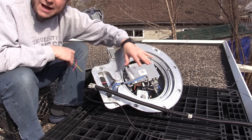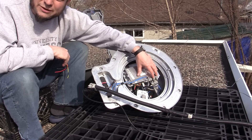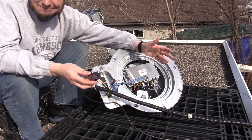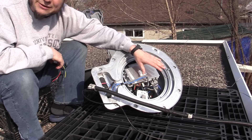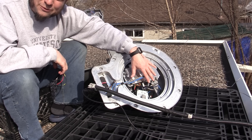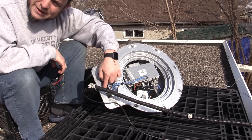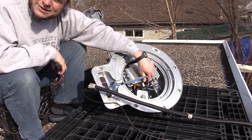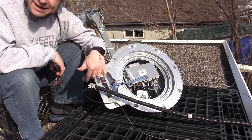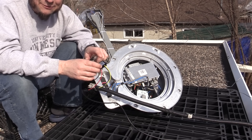I've got this flipped over and the bottom panel removed. I was going to put a little buck converter in here attached to the brain of the outdoor unit — this provides 16 to 18 volts, and it wants 12 to 24 volts, so that was going to provide 5 volts out to the first LNA in my RF chain. I realized I don't really need this though because there are already three wires that come from the indoor unit up to the dish through the center of rotation, so I can just have the power supply down below, run it through the coax cable, and have it come out to feed the amplifier.